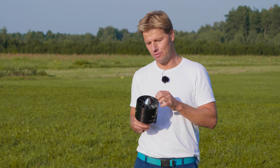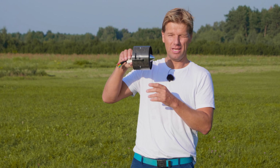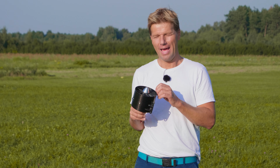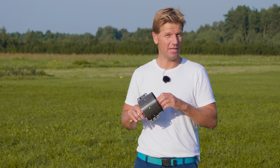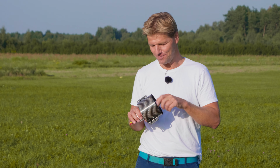So it's very important that the airflow is unobstructed, and also super important that you have a nice lip on the EDF drive. An EDF drive without a lip like this is not really efficient, so you have to have a lip. And in general, the bigger the lip, the better the efficiency. This is with EDFs. Of course, with turbines there might be something else, but we're talking EDFs.